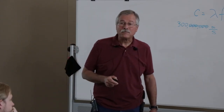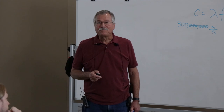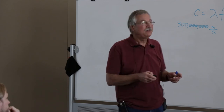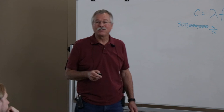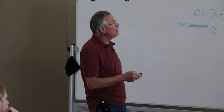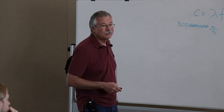Does the radio station have to then own that width? Yeah. So that, in a sense, the man has to talk at a certain... That's why you have a transmitter with circuitry built into it to limit you to that width. Yeah, it's not up to the announcer or the disc jockey to worry about that. That's the station engineer, and the transmitter has to be adjusted so as to not occupy more than this. Because guess what? There's another station over here and another station over here.